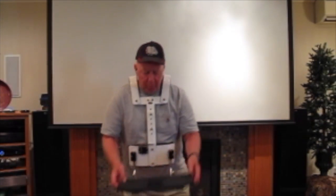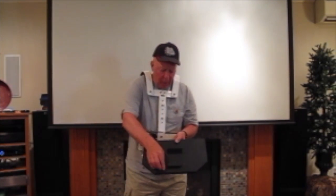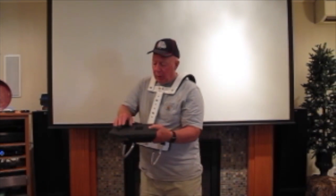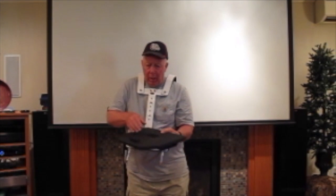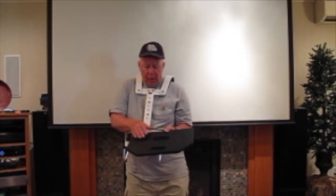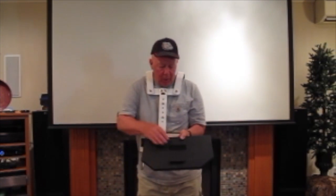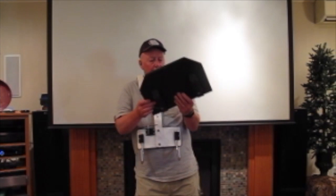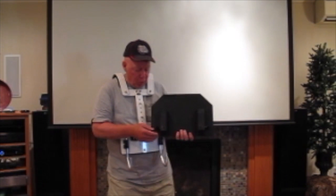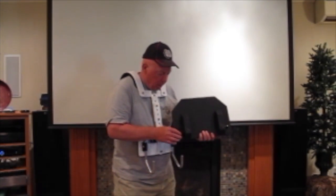So then I fabricated out of some plywood a little shelf. This is 15.5 inches wide by, I believe, 8 or 8.5 inches deep. This is the top. You can see there's a little cleat here, and there's a cutout, and that's for the front foot of the DJI Phantom controller to slide underneath there. Then here you can see a piece of hook and loop or Velcro. I got that from Amazon as well. On the underside there's a couple of cleats, and they're drilled through with a 9/16 inch hole, and here is a little set nut that clamps down on it.